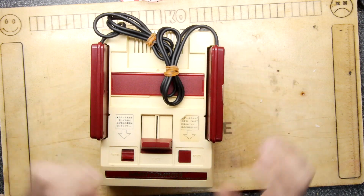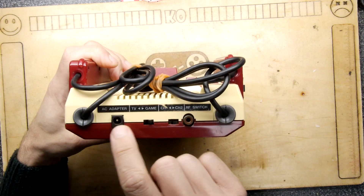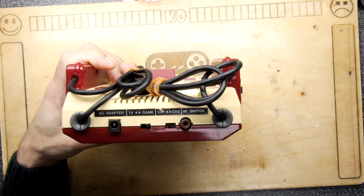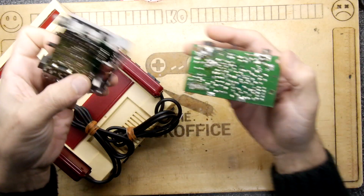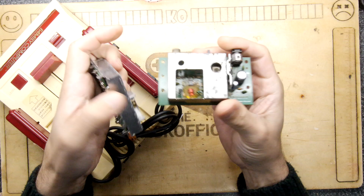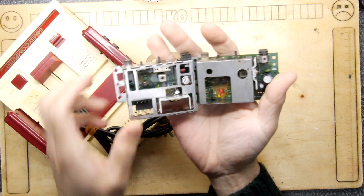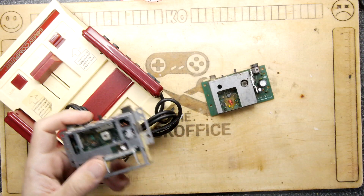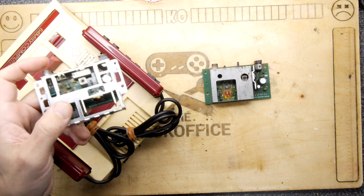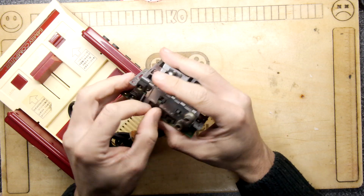It's got some original stuff going on there. And the problem with these, you can see on the back, you've got these nubbins. These are basically the modulation system. And there's two varieties. There is this one, which has several pins here in one corner, which is nice and simple. Then you have this one, which actually has the metal can soldered to the main board. So that's that one, or that one. And the problem with these, of course, they're RF, and your Famicom really doesn't like to work with modern tellies anymore.